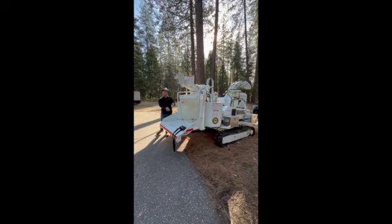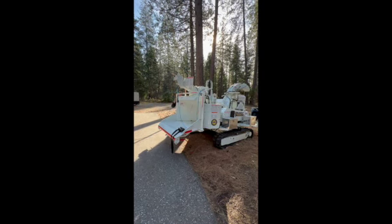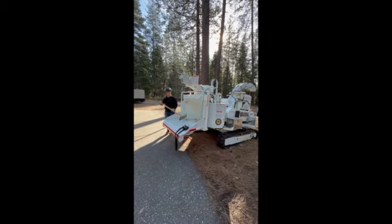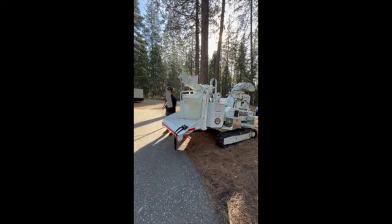Please do not stand on the infeed to kick material in. You guys think it's a joke. Unfortunately, there's been people killed doing that. Grab your foot. Bandit is going to supply you with this tool here. Please use this wooden pusher paddle to push that smaller material in. You should never be reaching past these last chance cables. Completely made of wood, guys.